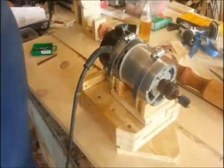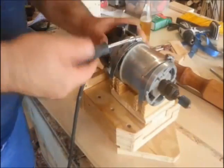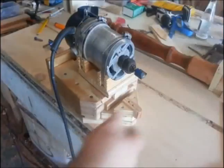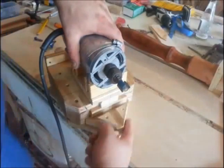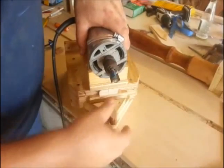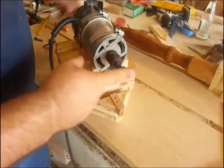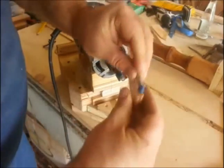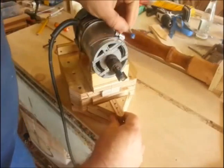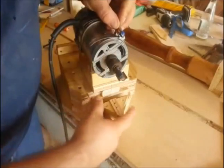Here I'm mounting on some more hose clamps to mount the router — it's a much better option for getting a nice tight snug hold-down. What I've done is build up this nose here and made a slot that I can slide different pieces into, so I can make different profiles to match whatever bit I'm using. Then I can just screw it down in place and follow a profile along an edge.